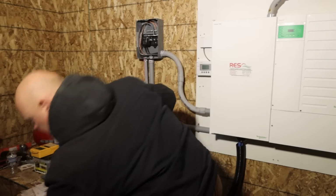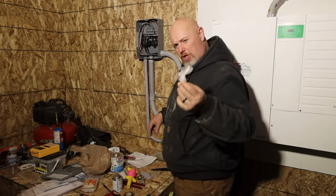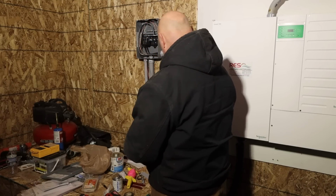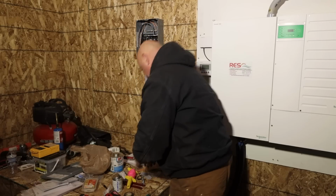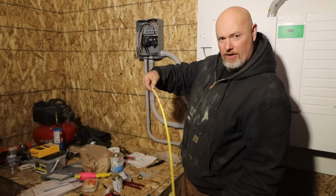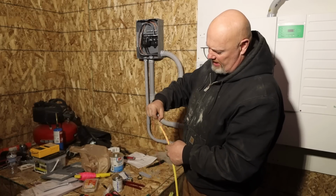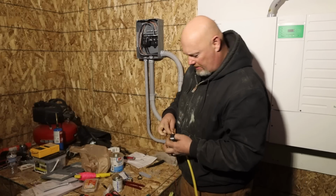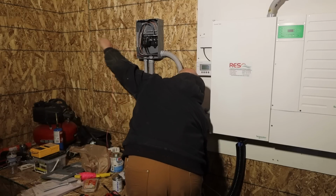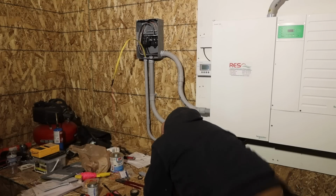That's quick. I just used a little piece of plastic bag, and it gives the vacuum a little more surface area to suck on. Some of my electrician friends call it running the mouse through a line, or various things, but it makes it real nice and easy when it comes to trying to pull a wire through that you can't get through. Okay, now I'll just tie it on there. It's kind of like a timber hitch, the way it's half hitches around there, so it sucks down tight on it. And then I'm just going to tape it on there. There, you got her. Perfect.